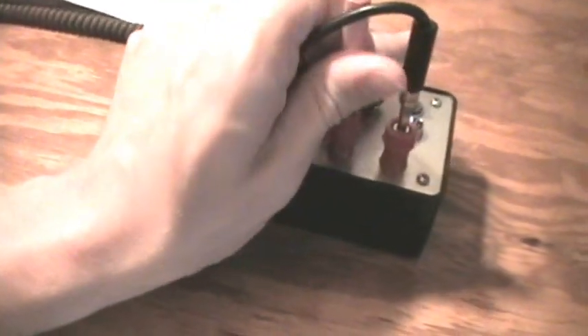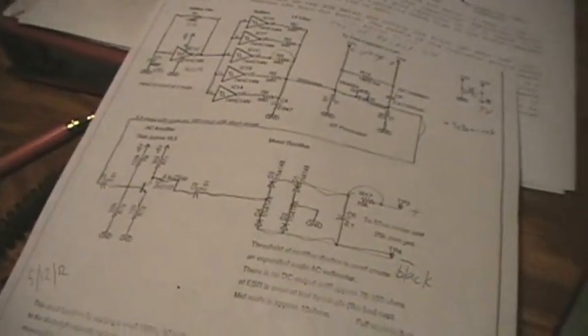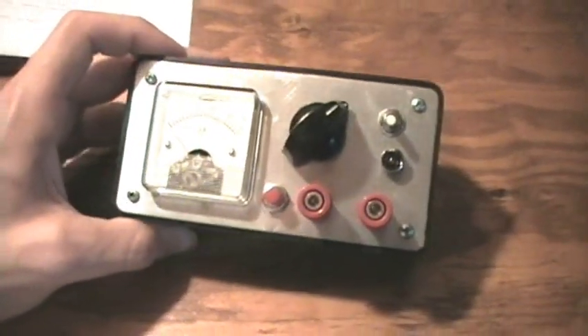And Clydesite, if you are seeing this video, I suggest you search 'ESR meter circuit' on Google or Bing — I think it was the first result — which is a site about a homemade ESR meter describing all about it and has the schematic. I recommend you build it, because that will be a much better way of finding a leaky capacitor and may greatly help in your tape recorder endeavors, perhaps even in fixing that RCA 3-inch reel-to-reel tape recorder with the bad amplifier. Even if it's a DC bias recorder, being a portable reel-to-reel, I think it's well worth the effort to fix it — they're such fun, neat machines.